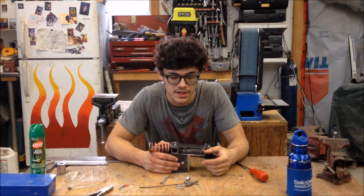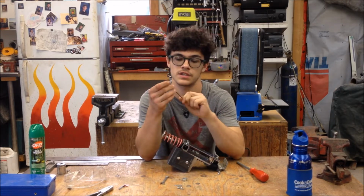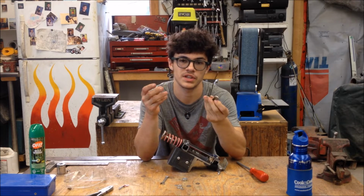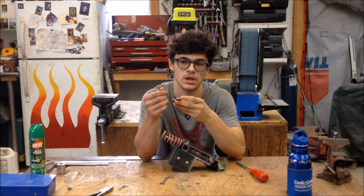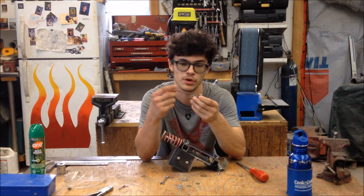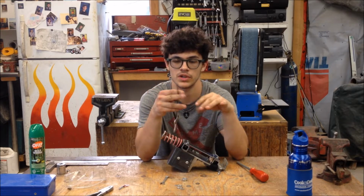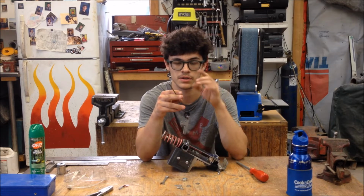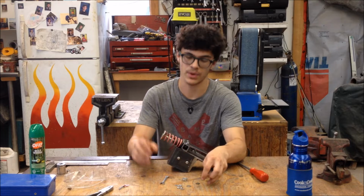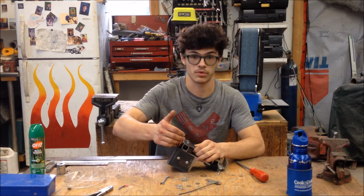Everything else is strong besides that bolt, and something else that needs a bit more strength and also more surface area is the little pin here. The pin itself, I find when I punch into something kind of soft, it just pokes clean through the object instead of actually triggering the trigger. Because the trigger force is stronger than this, so it just kind of pokes through. I need a flat piece of steel that I can bend 90 degrees to give it a nice little square surface area, and make it closer to this too. And then that way I should have something a lot better that will actually trigger the fist properly.